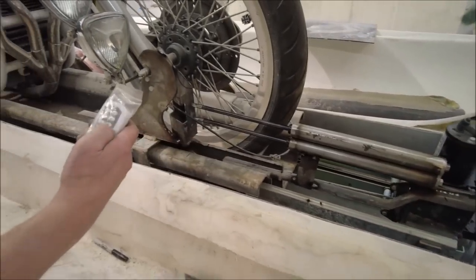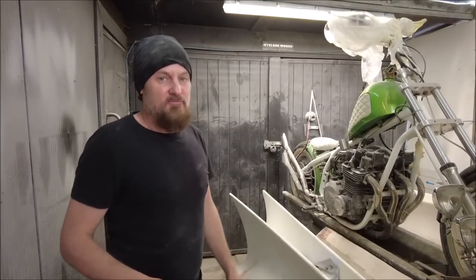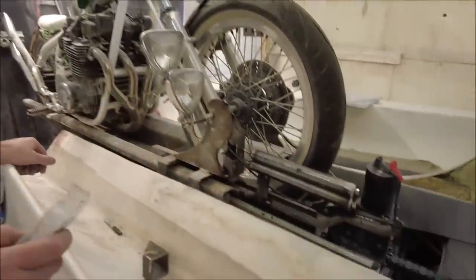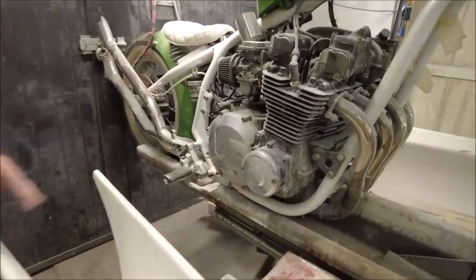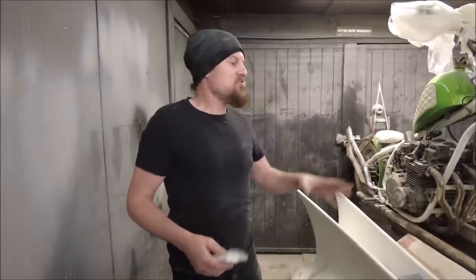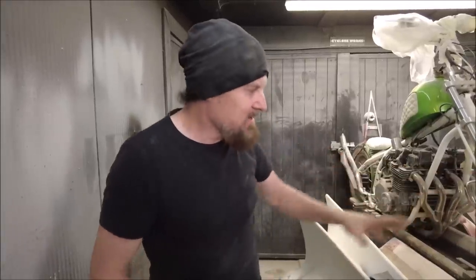These rams attach to this, which is the sled. Now, that compresses the rams, and the bike's fully on there - this is how the whole thing would slide forward and go in. But now when we go back, because gravity's never there when you really need it, and because we can't slope it - if we drop this here it hits the bodywork - we've got these rams to act as our false gravity, to push the bike back. And from beyond that point, once it gets to there, we've got clearance to drop this down, and then gravity takes over. Those two rams have saved us so much work, and they need no extra electrical - they're just there, they will just do that forever. This has worked out really, really well, and Lee's made a great job of it. Once we've got all the back on, it will be superb.